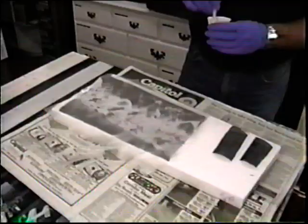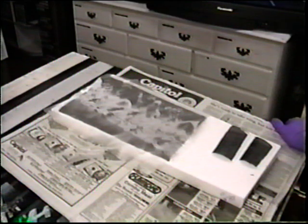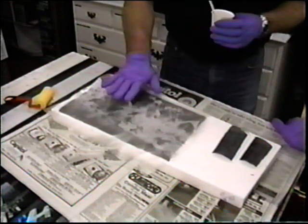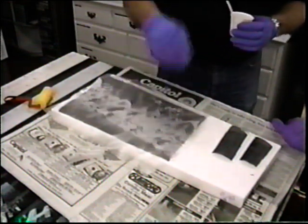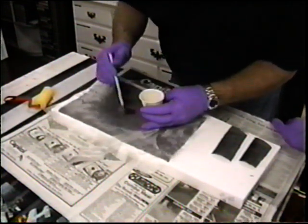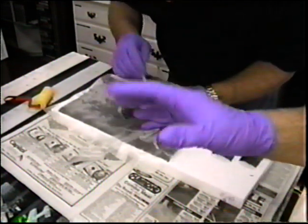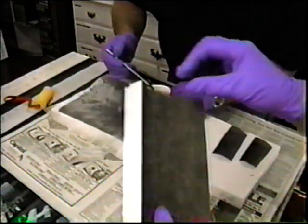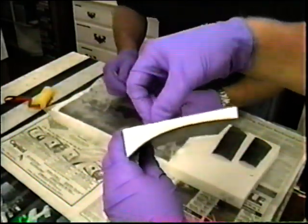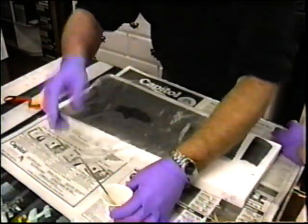That's too shiny. The exact thing you want to do is do this with the roller. You want to put the roller resin onto the core? What did you decide you wanted to do? No, I want to place this stuff on the core, roll it right there, and wet it from the top. Okay. See that? It's wetted. Now, we've already found out that the biggest thing where these tests are picking up weight is where in between the foam beads there's globs of cured epoxy or white glue or whatever. Hold on to that. Don't let it turn over.